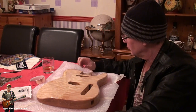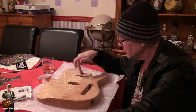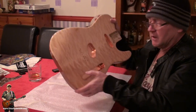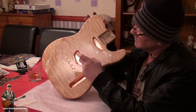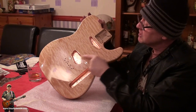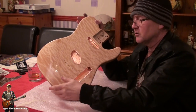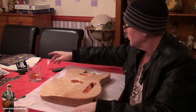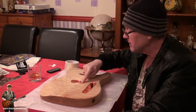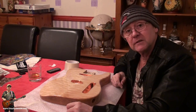That's why you get noisy Strats and Telecasters - I always use this copper tape to fill the pockets. After doing that, the pockets should look like this: completely filled with copper, with just a tiny little rim around the edge of each cavity so whatever you put on top can seal it all off. The only other thing to do is take masking tape and mask everywhere inside but not around the top edge - just to stop things shorting out as we build the guitar.